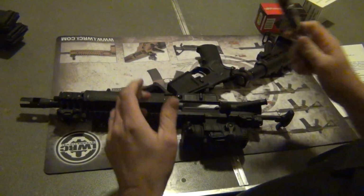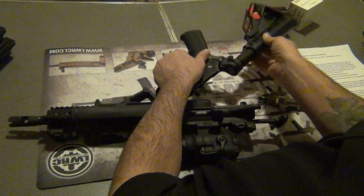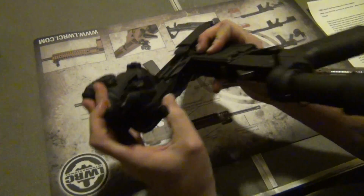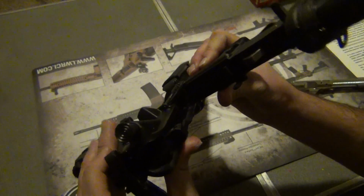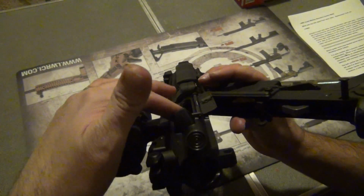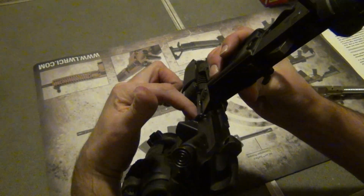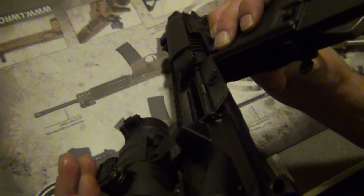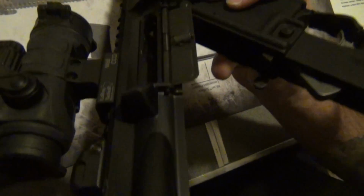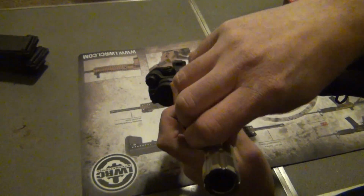So pretty much standard. I'm going to show you guys real quick inside. See right here, sorry for the low light. But you'll notice right away, it looks pretty standard from what you're used to. You've got your brass deflector coming along the side. Inside here, the star chamber is normal. I don't know if you can really see down there, but instead of the gas tube, what you have is the piston rod. So that's pretty much all that's different on these LWRCs.